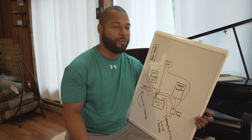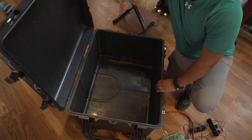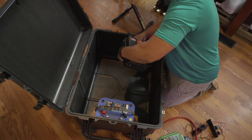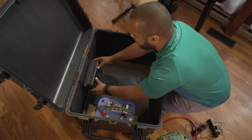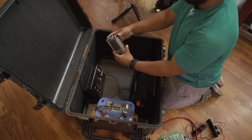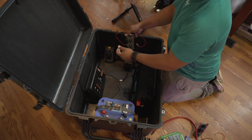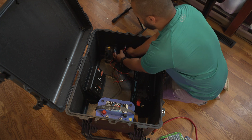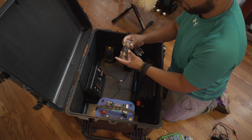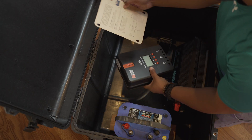Let's start building. This is the Pelican case — as you can see, there's a lot of space in here. I have my battery going in this block here. Next is my 40-amp solar controller, which I'm going to install somewhere around here. This is a pure sine wave inverter, going somewhere around here. This is the fuse block — I'll put links to all these items in the description. This cigarette lighter and USB connection goes around here. The 200-amp fuse and its cover — when you buy this from Amazon you get two fuses; make sure you remove the second fuse so it operates at 200 amps.